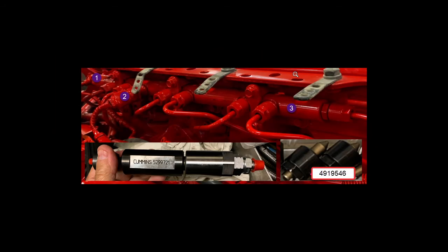The last thing we're going to look at is the tooling used on the common rail itself. On the left, you have 5299-721. This tool simulates injector load on the common rail — there's a high-pressure spring in it maintaining rail pressure. With this tool, you block all ports off on the rail except for the dump, the port that feeds the rail from the pump, and one other port that this tool screws onto. A line screws onto the far end of the tool and goes down into the beaker that measures your fuel flow. We'll talk about those amounts in the next video.